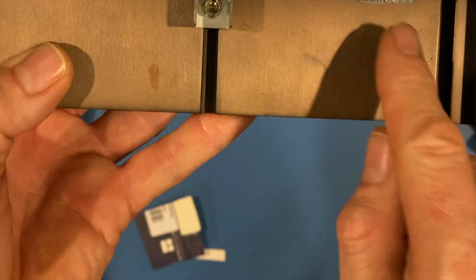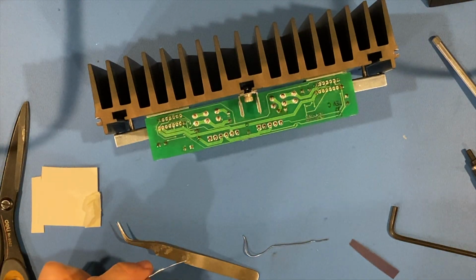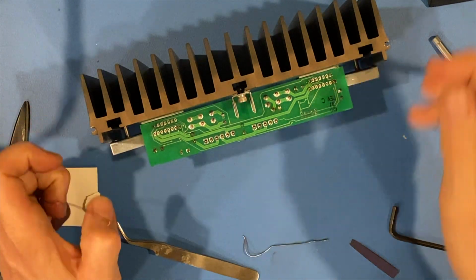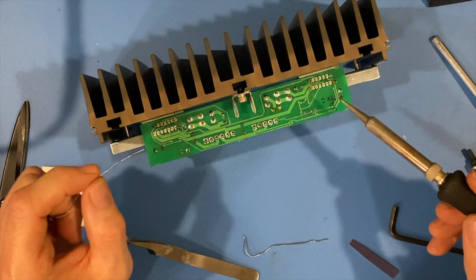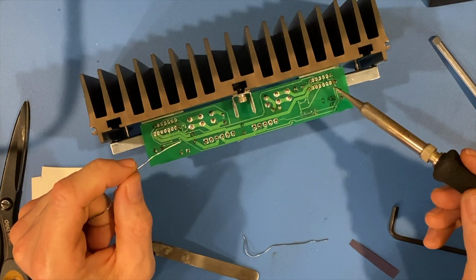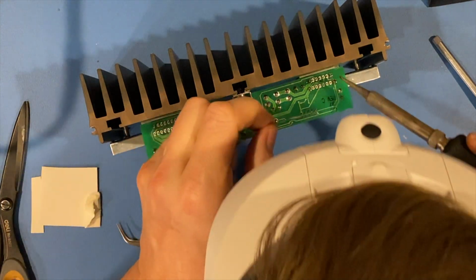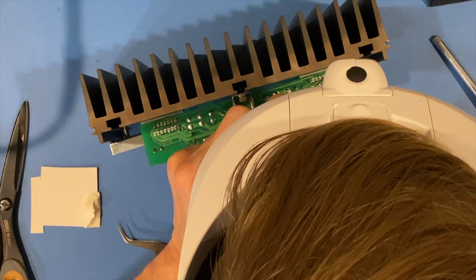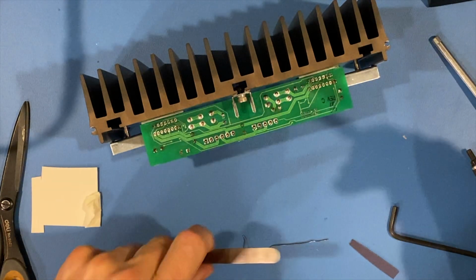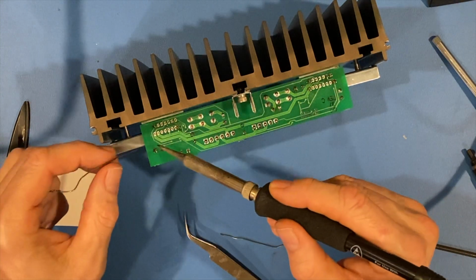And I'll go through and I will solder all those bottom pins. Since these are such fine ICs, you can toggle along and take care of them all, pin after pin. But when you have so many pins that are so close to each other, I think it's good practice to give them some cooling off time between solder joints. So what I like to do is I'll do one here. Make sure that puppy's good. And then I can take a heat sink, in this case just the tweezers. That's good. And then I'll come over to this one.